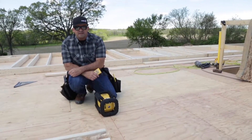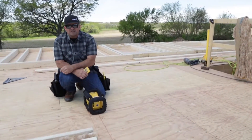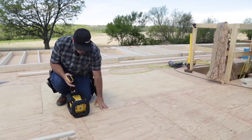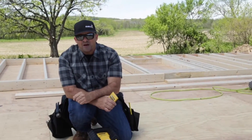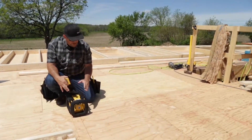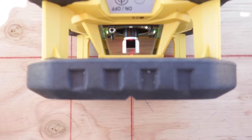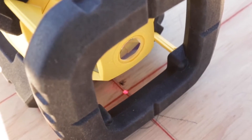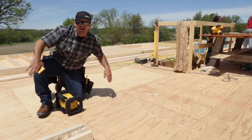What we're going to do now is set up the LER-350 for interior partition walls and long-range control lines. We're going to shoot in the long side of the building here, then pick up the short span. With the LER-350 laying on its side, it allows us to pick up a 90-degree square — you're going to have your rotary beam one way, and then you're going to be shooting a dot out to pick up the 90. I'm going to show you the fastest way to set up your laser. If you look at the actual laser, I have it established on one control line, and I'm going to pick this wall up. There's an incremented groove right here in the laser head itself — that determines exactly where to place this to pick up your 90. That splits the center of the diode, so now you're going to be dead center one way, and then we pick up our control line the other way.